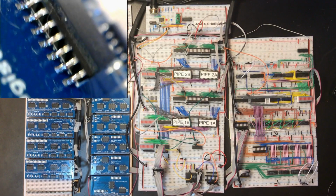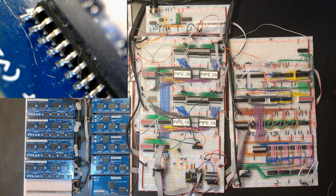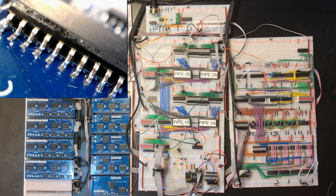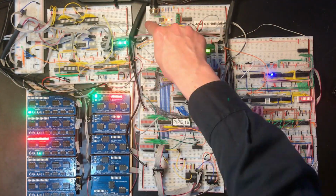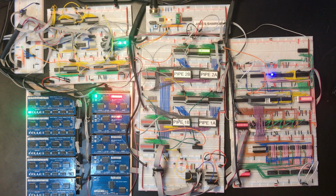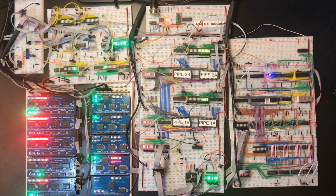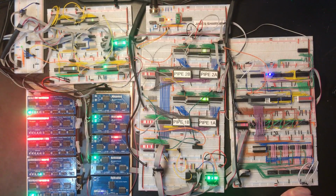It doesn't look like any aren't making contact, but this does have pins that are higher off the board than normal. The weird flickering there was me telling this register to load from the bus without telling anything to assert to the bus. So it effectively just had random inputs. Okay, well, we understand it. There is a 1-bit error on this board somewhere. That means it's not getting out. But everything else we've looked at is working correct.